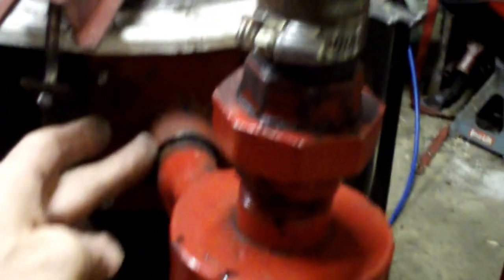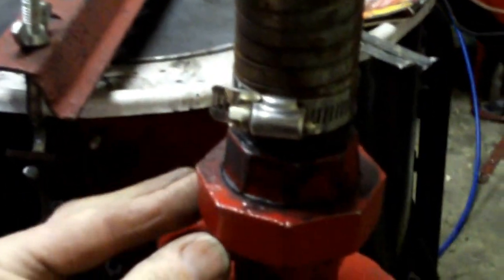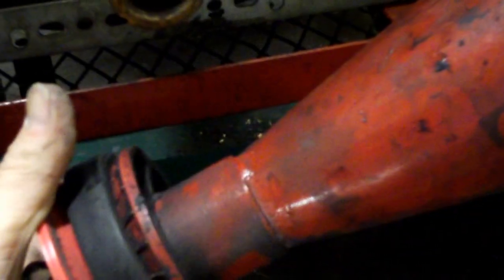I'll put on the pipes here. The gases come out of here into the cyclone, and I have an inch-and-a-half pipe fitting here. The gases then go through this — most of the heavy dust is discharged into the cyclone. It can be easily cleaned out by just removing the base and dropping out the interior, which would have the dust in it.